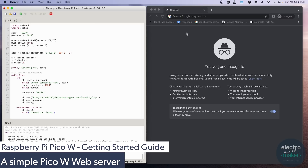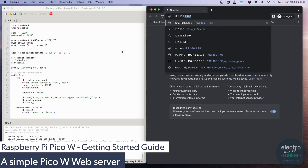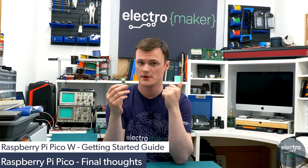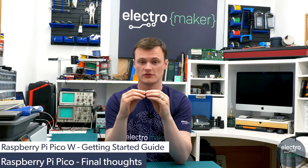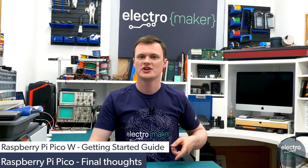Now let's see what happens when we connect to the Raspberry Pi Pico W over the LAN. You can find the device's IP address from your router or by writing a small function to return it. Entering 192.168.1.163 in the browser and hitting enter, we get the response 'hello' — generated by the Raspberry Pi Pico W. Even with just one example, this demonstrates the power of MicroPython and the new Pico W. You get a board that's small, lightweight, with Wi-Fi capability, backwards compatible, maker friendly, and prototyping friendly — which makes the Raspberry Pi Pico W an absolute sell. Visit the ElectroMaker store if you're interested. Thank you for watching.